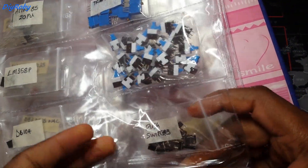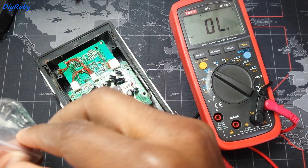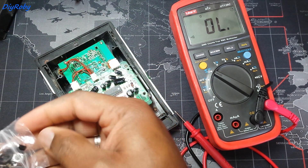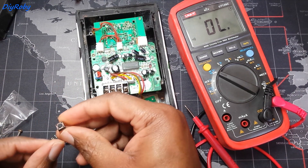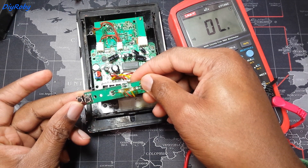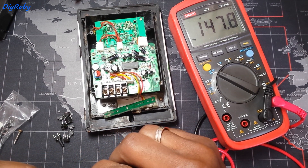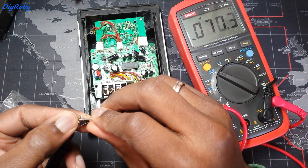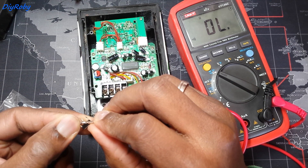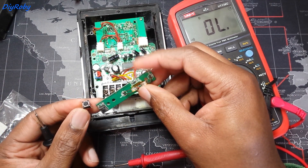What I'm going to have to do is clean up and solder fresh heads on those cables back to the pads. But the most important thing is to replace the push switch. I have my folder of small electronic components — a hobby collection built up over the years — and I was able to find an exact replacement button. You can see it's exactly the same. Testing it with continuity, the button makes contact on the two pins on the short side.